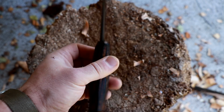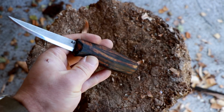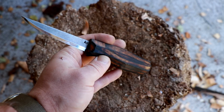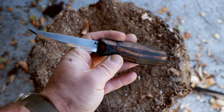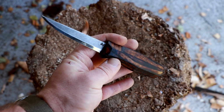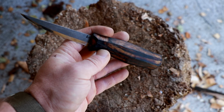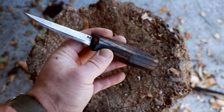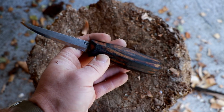And you know what? To be honest, in carving knives and in knives in general, the whole peening over, pinning, putting pins through, all this kind of stuff, if you epoxy a knife in, and epoxying by itself would hold the knife already if you make sure to use the right epoxy and degrease anything. But putting them in with a dowel method, what I do with my Yakut knives and pretty much all other blades as well, is bomb proof. That wood would crack apart and fall apart before that epoxy lets the knife come out.